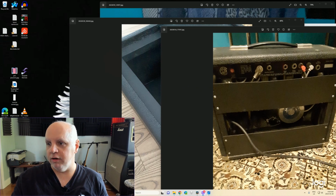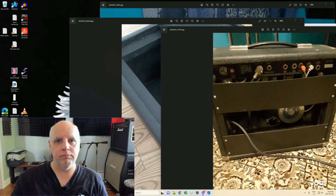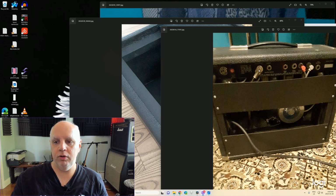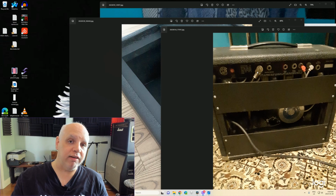Yeah, no, it's musical intelligence, but I didn't think this one all the way through. So there's only one speaker out. It's this one here, right? And it's wired for 8 ohms. Now I could think, well, if you could do 2 8 ohms, yeah, but depending if you're doing it in parallel or series, you either end up with 4 ohms or 16 ohms.